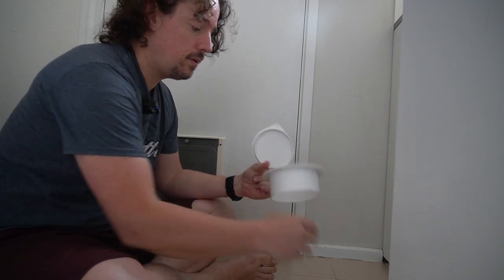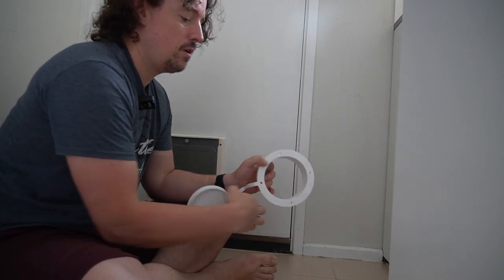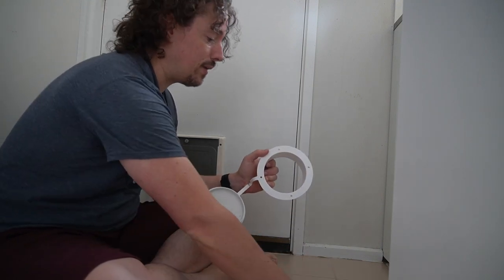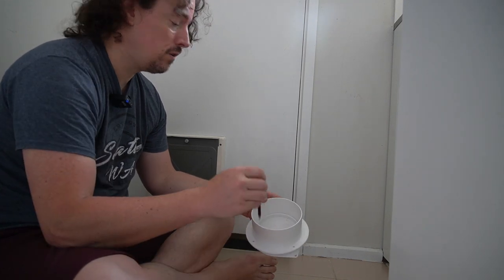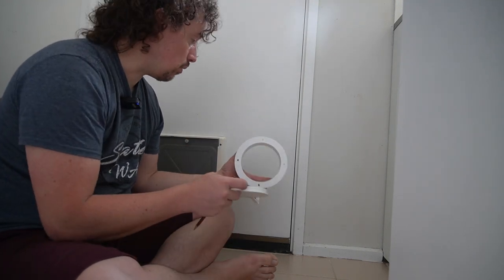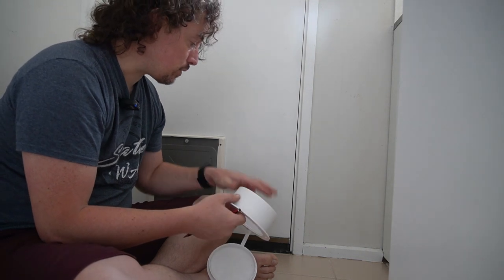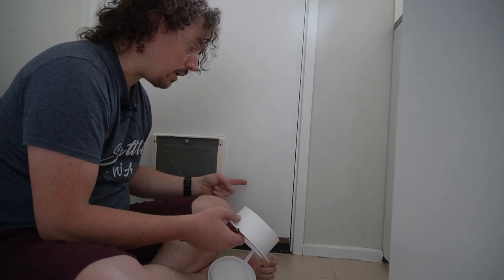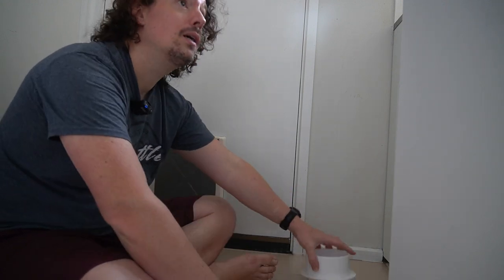So this is the bit that goes in the door. Once that's in, we've got a cap to close it off, and this bit attaches to the hose and goes straight in there so we can remove that. I'm going to need to pencil off the sides, but one thing to bear in mind is there's going to be a block of wood there somewhere. This door is hollow — there's just plywood on this side and another piece of plywood on the other side. I need to go through the whole thing, which is going to be wider than the door. So I'm going to drill a hole roughly in the middle to find where the wood is and work out where I can actually position this. Let's drill our first hole.